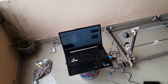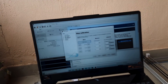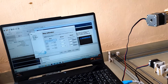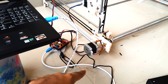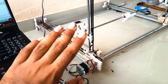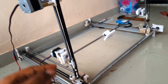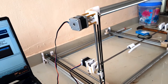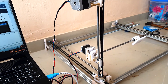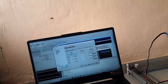The problem right now is I was trying to do the step calibrations for the stepper motors, but these motors are just not responding to the inputs. These are 4.2 kg per centimeter motors — that is 4200 grams of load one motor can take — and we have just 2000 grams of load on one axis. According to our theoretical calculations the motors were way overpowered and could easily manage, but right now when we are trying, it is not happening.